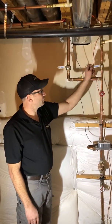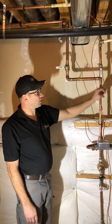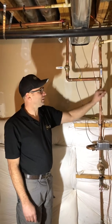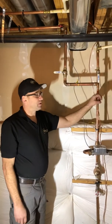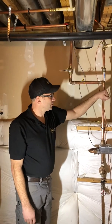There's your off and your on. These gate valves are always clockwise — righty-tighty. You basically want to keep going until it's kind of snug. If you go too hard and crank on it, you're gonna end up breaking these and you're gonna end up calling us out.